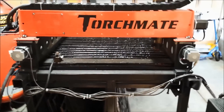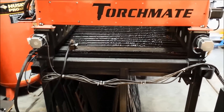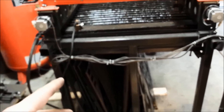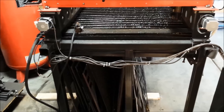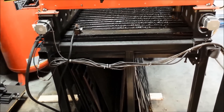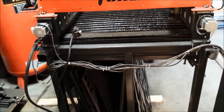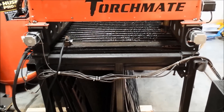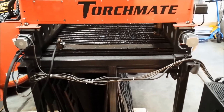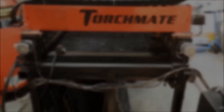What I plan on doing is raising up the whole X and Y axis using a screw jack. The screw jack elevator I'm going to build will have a section for each corner of the table to raise it up simultaneously. Everything will be chained together with sprockets and chains, and I'll have one location where I use a drill or something to raise it up — because everything's connected, it should raise up simultaneously. I've seen something similar on the web and it worked well for a CNC machine without causing any binding issues, which is my biggest concern, but we'll give it a shot.